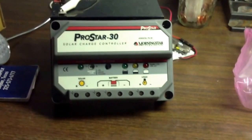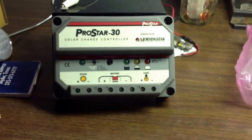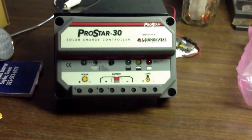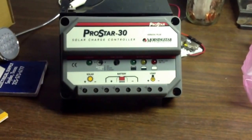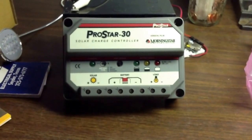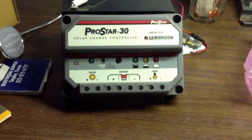If you want to get started, this here is not too terribly expensive. A very simple solar system would be one solar panel, a good deep cycle 12-volt battery — make sure it's deep cycle, not a car battery — and then your load that you're going to use. There's a ton of resources on YouTube and on the internet with great information out there. I highly recommend if you're going to do something with solar, start small. Watch all the videos — the guys putting them out have made the mistakes and they'll tell you what works, what doesn't work, and steer you in the right direction so you won't have to go through some of the expensive mistakes others did.